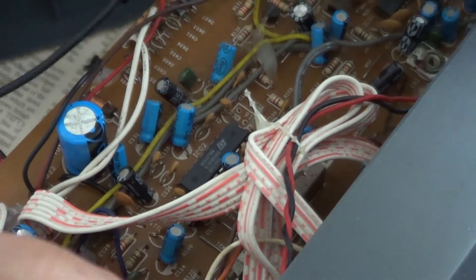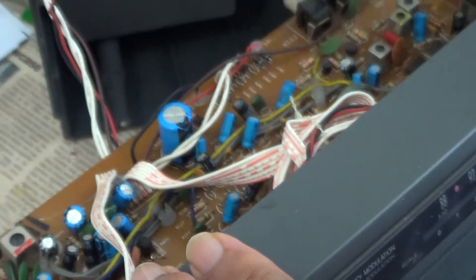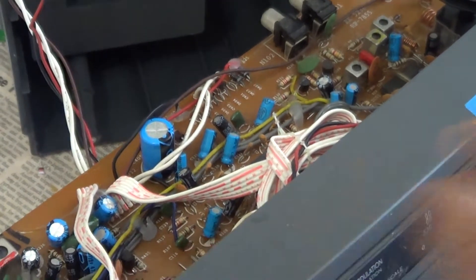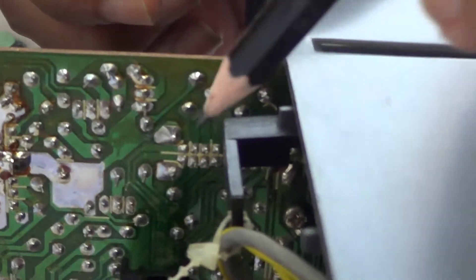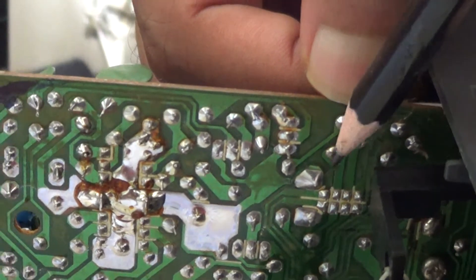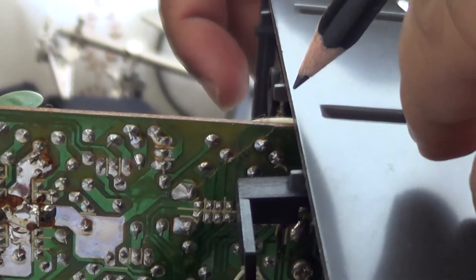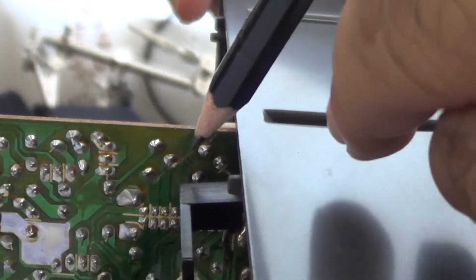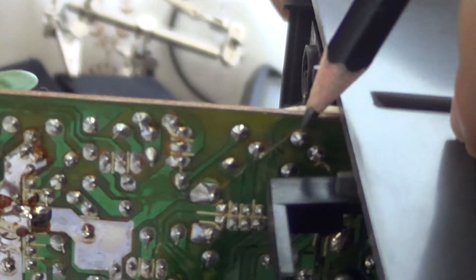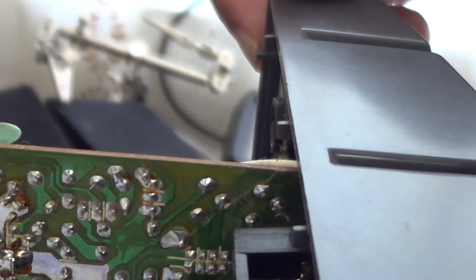At the same time, I could pulse the preamp with a signal and see if there's an output. But I will look at the circuit board running from the FM chip to the preamp and see if I discover any discrepancies there. After tracing the circuit board, what I found is that a crack was existing along the circuit board. This crack coincided with the auxiliary switch at the front. So my best guess is that this is cutting off the signal from going to the power amplifier.